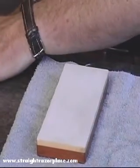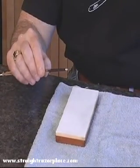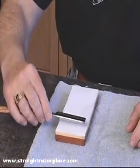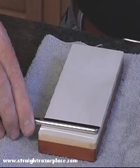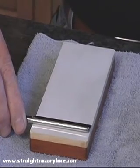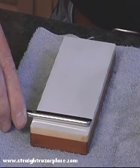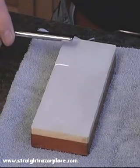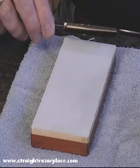For razors that are simply in excellent shape, we're going to start with the 3-3, 1-3, 1-5 pyramid progression on the stone. Because this is a 3-inch stone, most of the length of the blade actually goes across the entire stone. Of critical importance when honing is that the blade remain absolutely flat on this stone throughout the entire course of the stroke. We bring it on a diagonal from the heel to the toe, roll it on the spine, and then again on a diagonal from the heel to the toe.